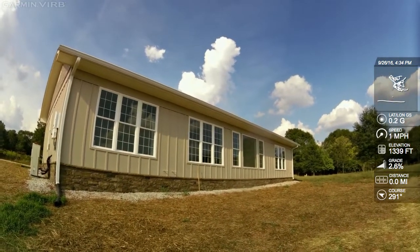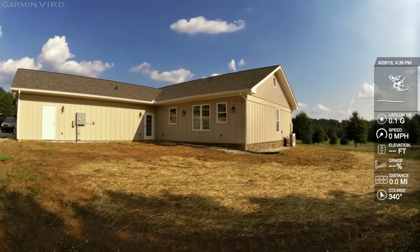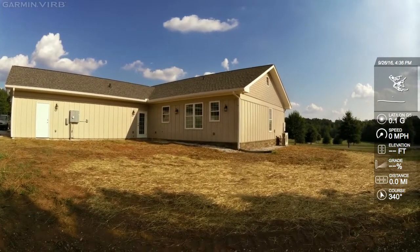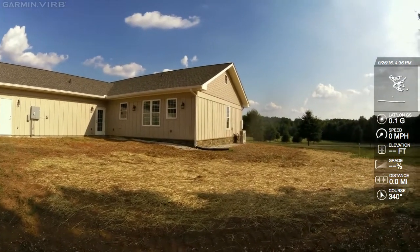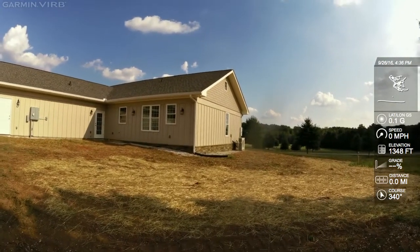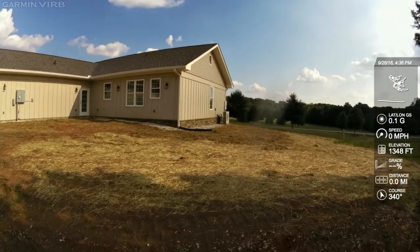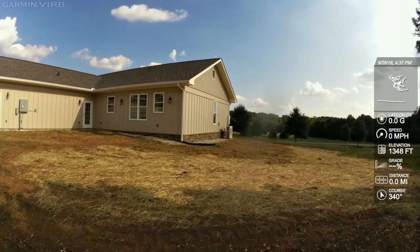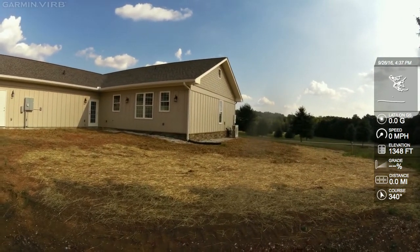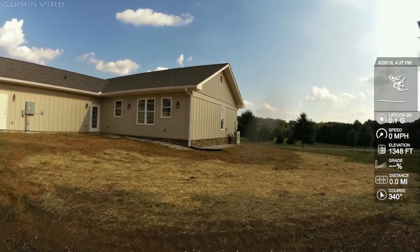It's like having a thermal battery. One of the key principles of passive solar design is to minimize your north windows and more importantly your east and west windows, because you tend to overheat in the afternoons and summertime. This house has just one window on the west side. I go into a lot of houses where people are cooking, and when we get down to the problem, it's a west-facing window put in for a view that heats the house so hot in summer the air conditioner can't keep up.